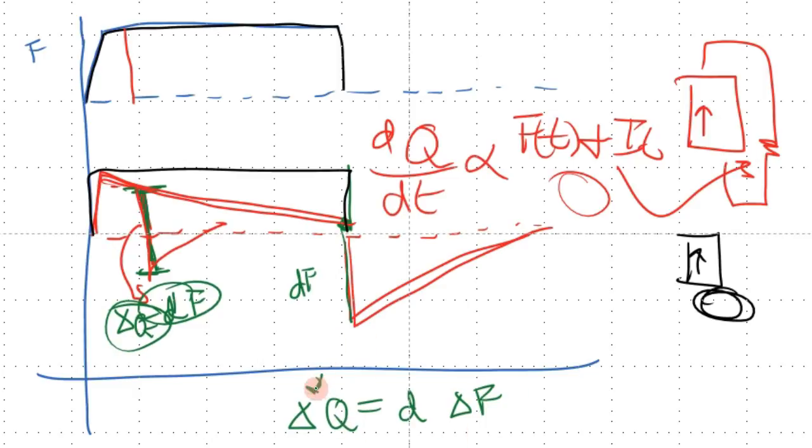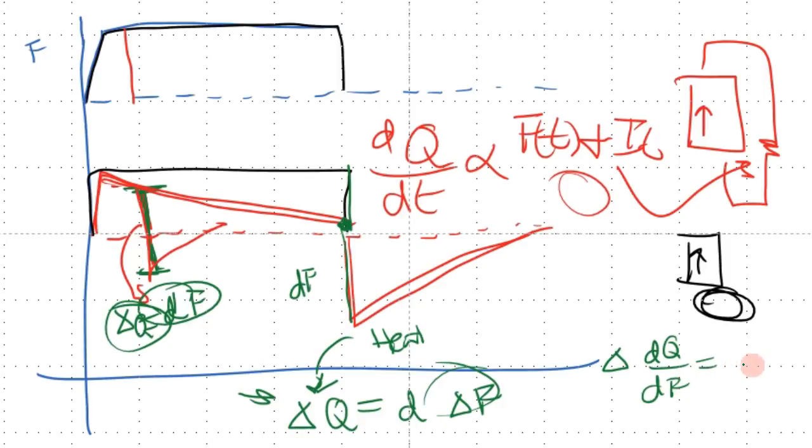Charge can be present for different reasons — for example, if you heat the piezo, charge develops, and then you apply force and get a different charge. So ΔQ = D·ΔF, or equivalently dQ/dF = D. This is another example of understanding the piezoelectric d-constant as a differential relationship.